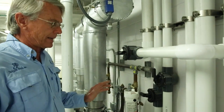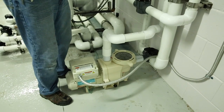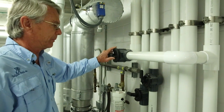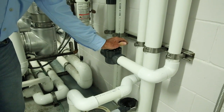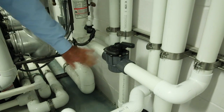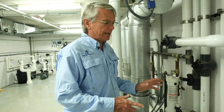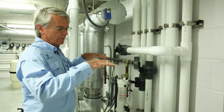The way this is set up right now, this pump is running at its fullest GPM rating. When you go to put the valves back into their normal operating position, this one is going to be totally wide open, and this one is at about a 10-degree angle from being totally closed. The variance means those nozzles out there will either shoot a little further or a little less.